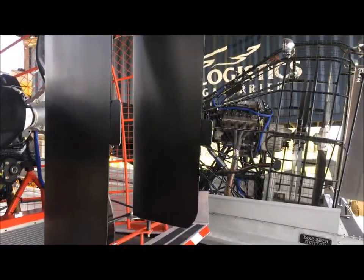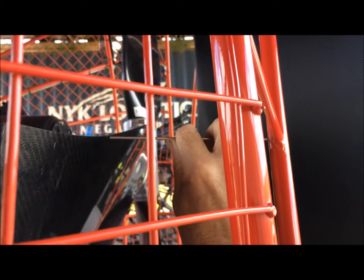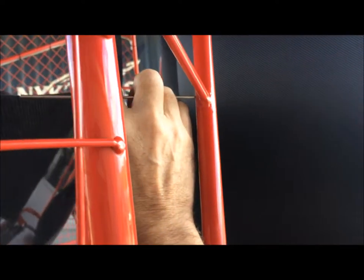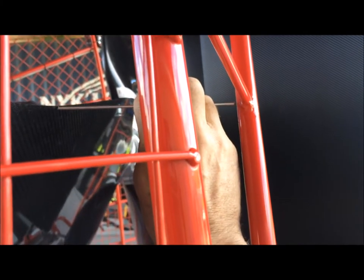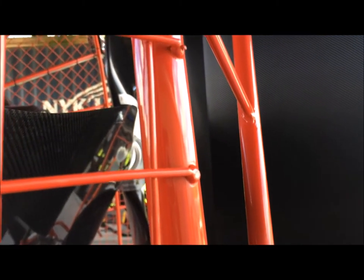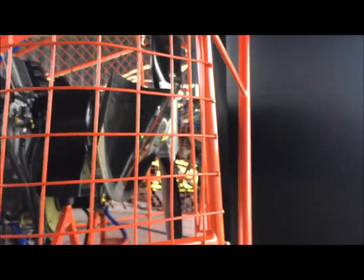I'm getting another angle here so you can see — this little piece of aluminum is cut so that it fits on both sides to a fixed place, and the trailing edge is how you set your leading edge to be always consistent for all three blades. If they're all lining up, then you've got your pitch set perfectly.